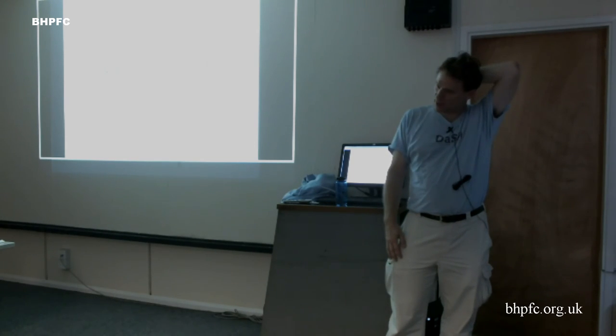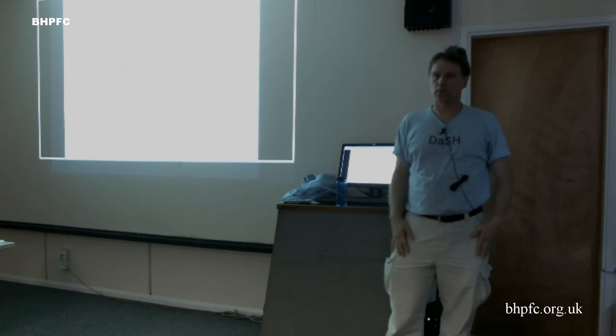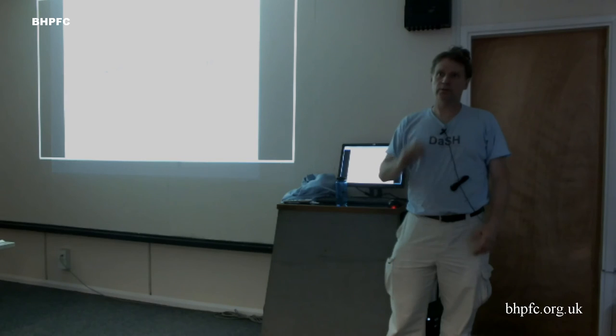That's the question. I think that mylar was the right choice for Dash for the back open part of the panels. The question is, what is the most effective way? If you're going to use Depron for your leading edge, what's the most effective way to cover the Depron? I don't know if we chose a somewhat heavy solution, and I'm not sure I would do it the same way this time. One way would be to use polyolefin. Another way would be to use a much lighter film. Do you remember the name of the film?